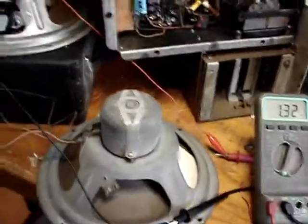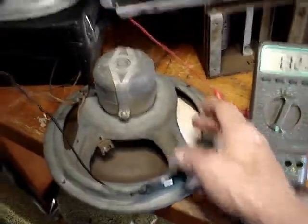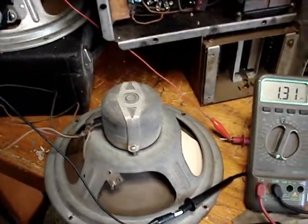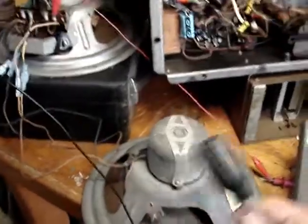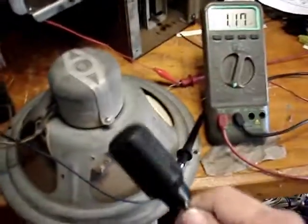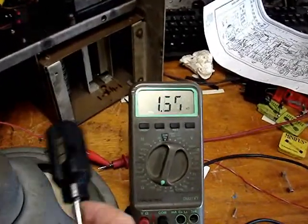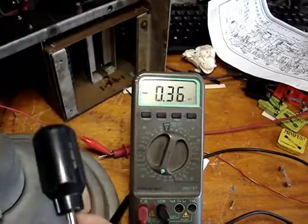So now an issue manifested itself. The fuse blew. After I got done patching all the cone on this thing, I tried to power it up and the fuse blew. Well, why would that happen? What changed? Well, the only thing that changed is I've been rotating the speaker all around working on it, but there's something wrong with the field coil in the speaker, and I'll show what's happening. If I tap it, there you go, see? Went up to 4K, all the way down to...